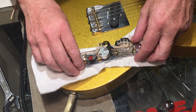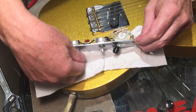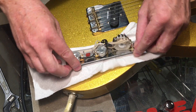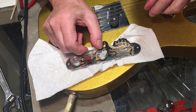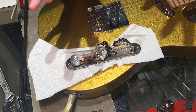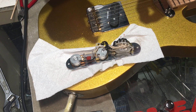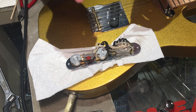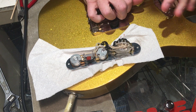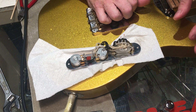So we're gonna listen to what we have. Controls, everything is working. That is connected to the center lug of that 500k pot, so the load of the circuit is effectively in place. What we're gonna listen for is the difference between the load of the circuit and direct to the amp. This is actually a nice mod, by the way, if you want to figure it for yourself.